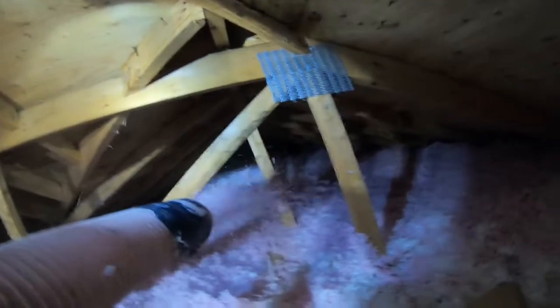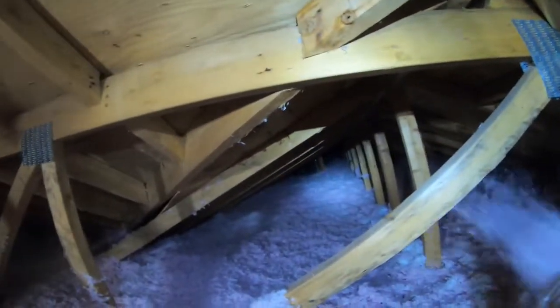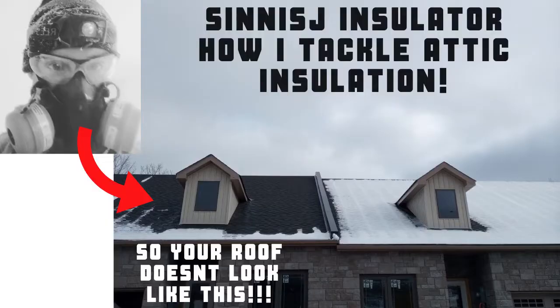I have seen many benefits of fiberglass insulation. I know it's not the greatest because you have to have an absolute perfect air seal, but I do install an R60 in every single one of my homes that I do a top-up for — so that's almost two feet of insulation — and during the winter I will look outside and I see a massive difference.